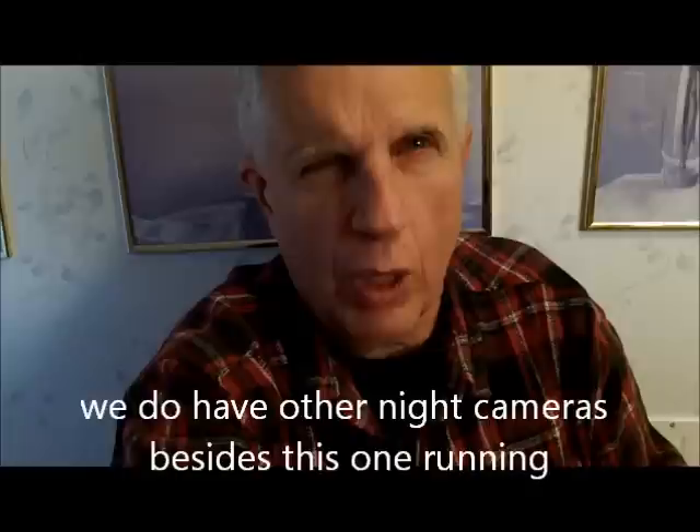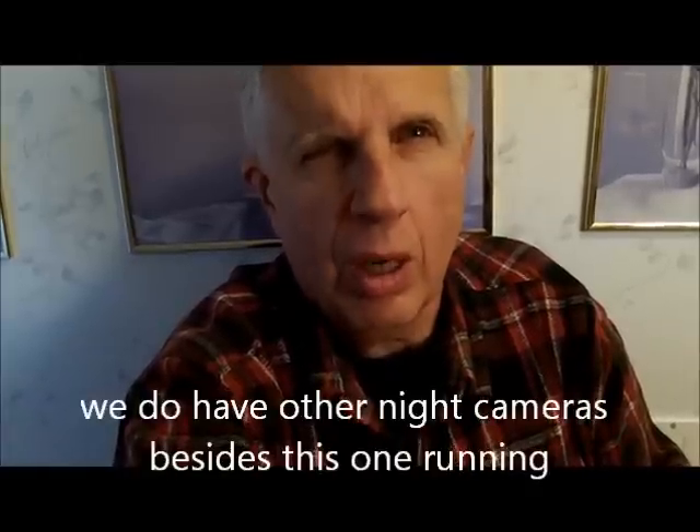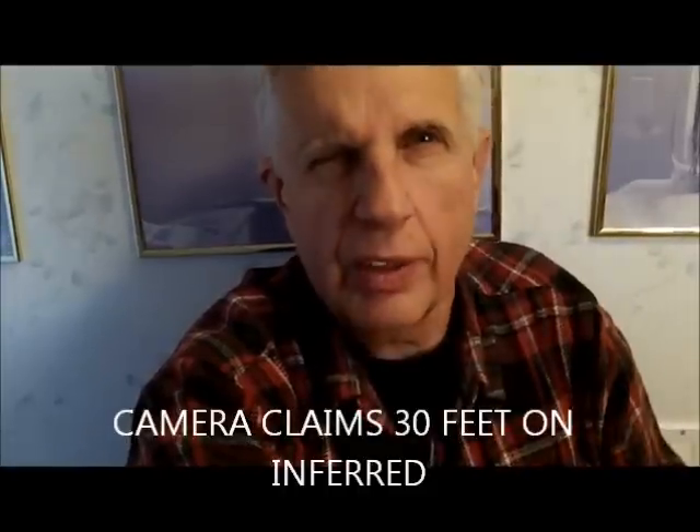So if you have a digital camera or a camcorder, this is how you can test these things out. Although with this particular night vision camera, you can see the glow with the naked eye — it's very faint, but you can see it. I got this camera for a night security camera. I'm going to be mounting it in a permanent, much more secure area — this is just a temporary test. The distance between the van and where I had it temporarily mounted is exactly 23 feet. That camera is supposed to illuminate to 30 feet, and it probably would if all the LEDs were working.